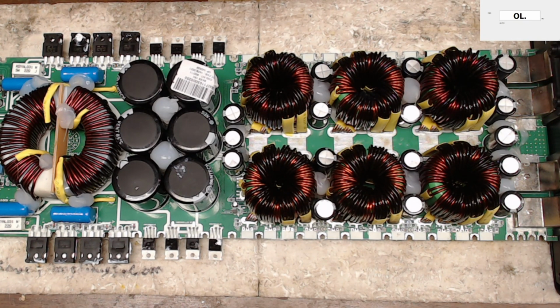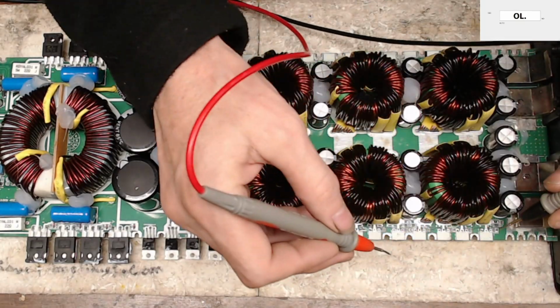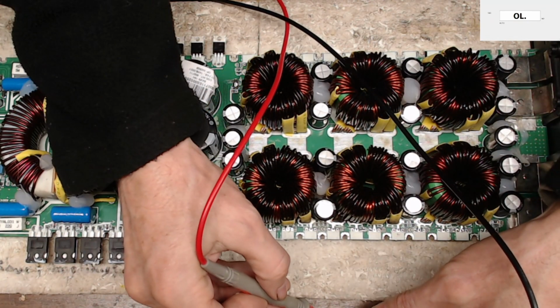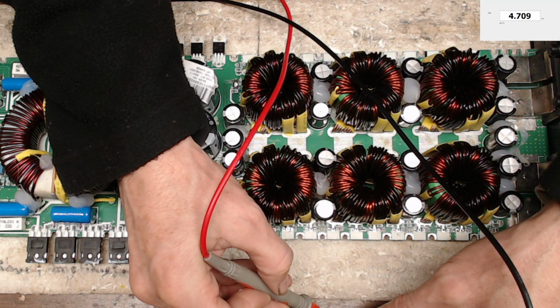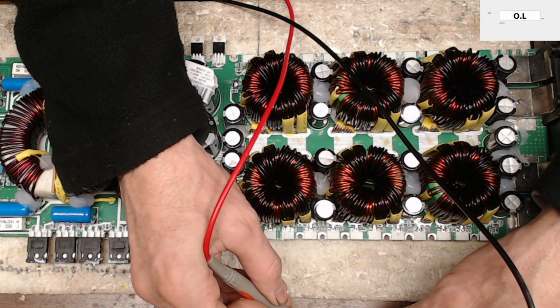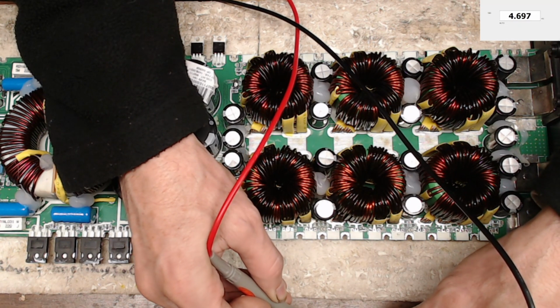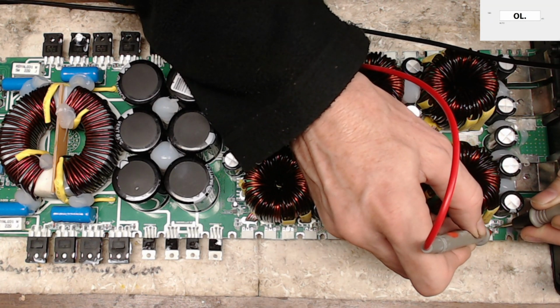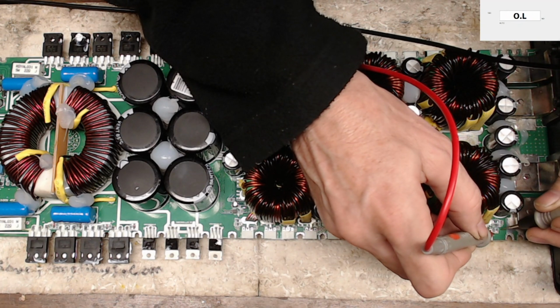I see a lot of questions about temperatures and air settings. Well, what I can suggest is that you just get a board that has SMD components and just start pulling them off and see what temperature works best with your style of repair work. So this gate resistor pull down is 4.7K, and this one was 4.7K. So the two resistors that I pulled off are good.